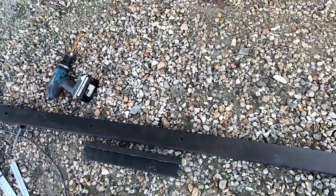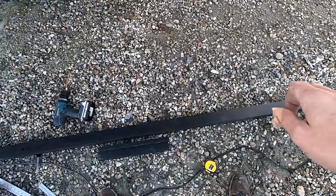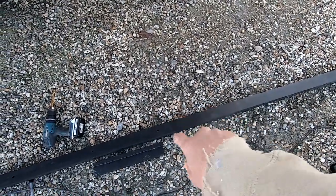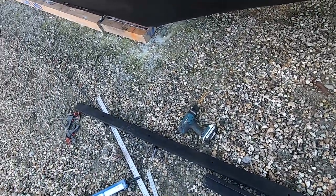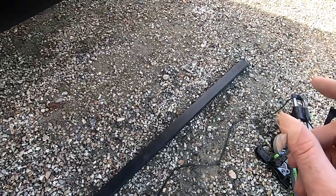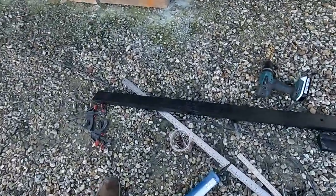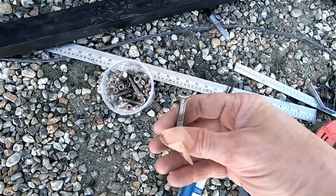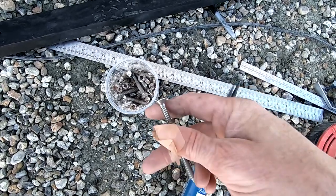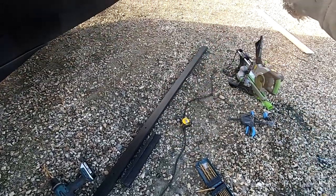Okay, so I've drilled and countersunk, and realised the self-tappers that I need to put in further up. It'll look nicer, probably more uniform, if I pre-drilled the holes in this now to be the same distance apart. I know these differ a little bit, but in and around, same sort of thing all the way down, just to make it look a bit prettier, especially if I keep the stainless heads rather than covering it up. The only thing is the self-tapping monstrosities that are in there, Philip said. So it's not going to look nice, but they're still A4 stainless. It's better than nothing. But anyway, I'm going to get the measurements on this for the head and everything, say equal distances, and pre-drill. So I'm going to get on with that, and then I'll see you for the putting up.